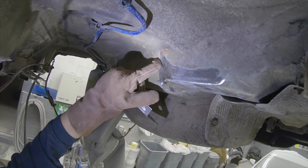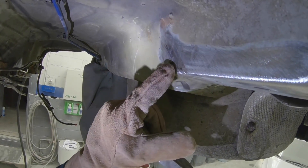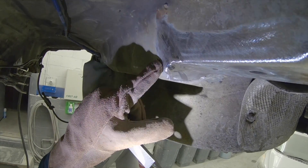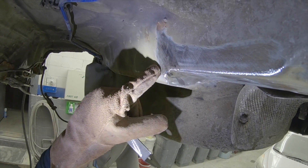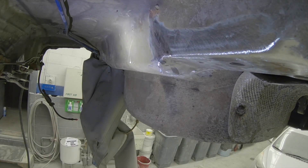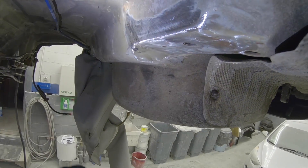After I drill the holes, I bead weld it down just to get rid of that split. This is the main brace on the car — you're going to want to look because it is the left rear and it has the most load. The drive shaft turns to the right, so it's going to pull down on the left rear first — this will tear usually on all of them. Now I'm just going to put the bolt in, put this plate on, and tack it up, then move to the last one.